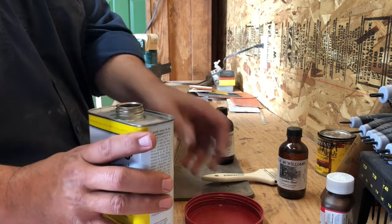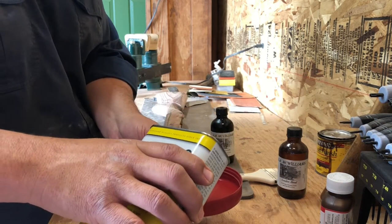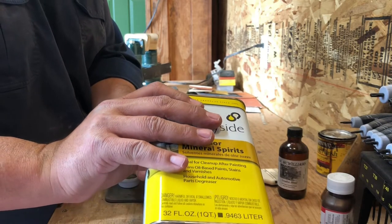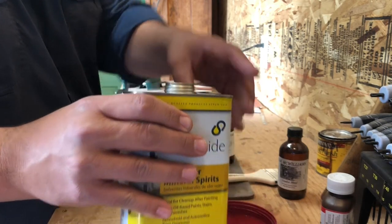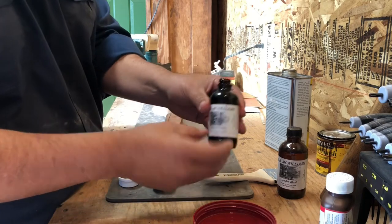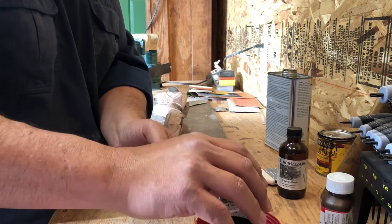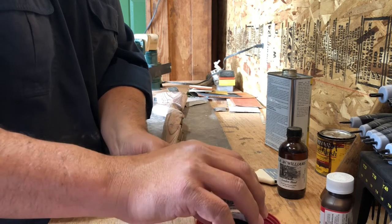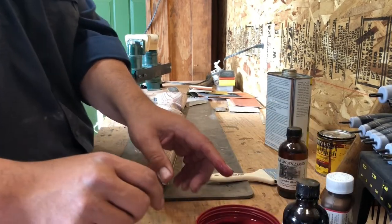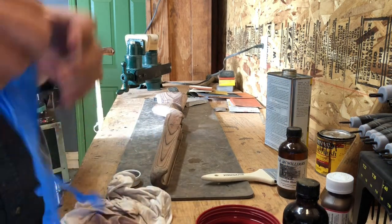I like to use 3/4 to 1/4. Before I've said 2/3, 1/3, but it's easier to measure something like 3/4 to 1/4, okay? So just get this in here before it spills everywhere. About like that, okay? And then take your finish, or your stain, and try and mix that to 3/4 to 1/4. I have forgotten a step. I forgot to put my gloves on. I'm always harping about that.